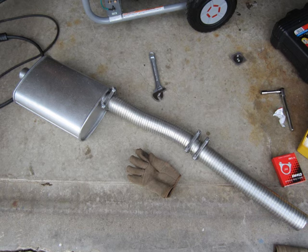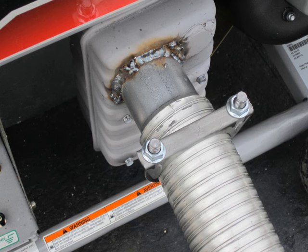This picture shows the car muffler and flex pipe assembly. I used the two lengths of flex pipe to get it long enough to allow the car muffler to lay flat on the ground. Different arrangements here may be needed for other gensets and different situations. I would have preferred to use a single length of flex pipe, but none of the stores in my area carried anything longer than what I ended up buying. Finally, I attached the flex pipe to the adapter that I previously welded to the genset muffler. I did not tighten the U-bracket clamp so much, since doing so would have crimped the flex pipe, making it more difficult to remove in order to facilitate storage of the genset, or using the genset in its original portable configuration.